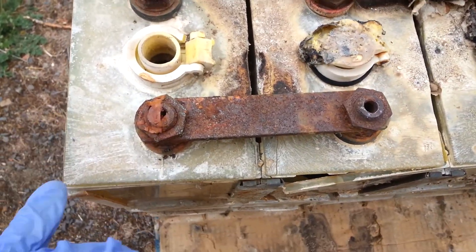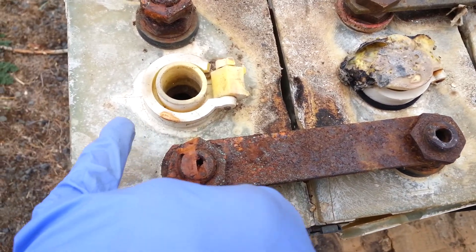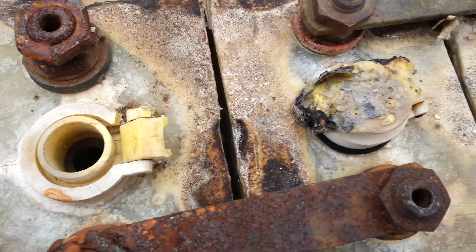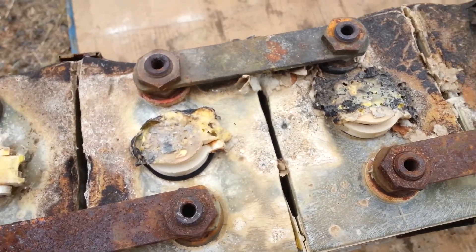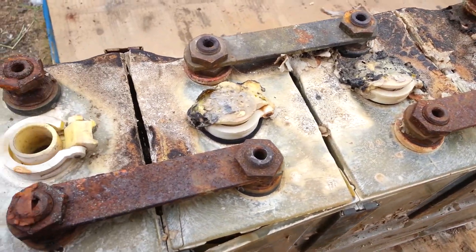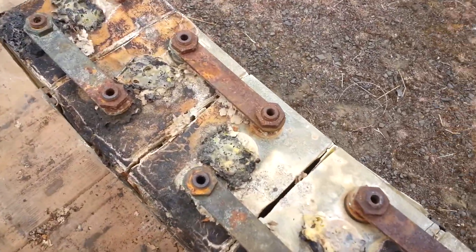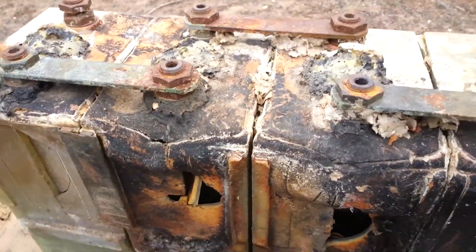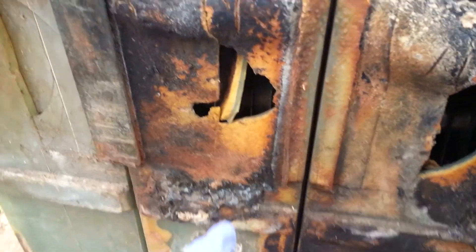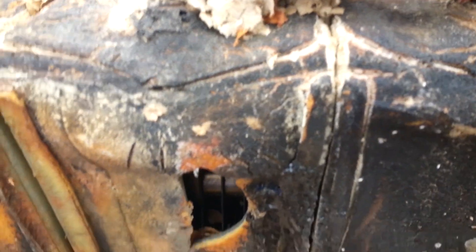I was doing some reading. What can happen with these nickel cadmium batteries is the water level can get below the plates. And then the plates arc and spark. These emit oxygen and hydrogen from the distilled water from the current — it's kind of a side effect; it's what happens when you charge them. So that arcing and sparking — maybe that's what happened here. It ignites and you have a hydrogen oxygen explosion.